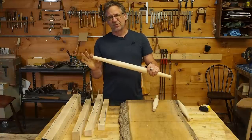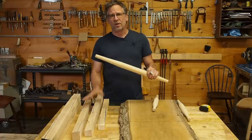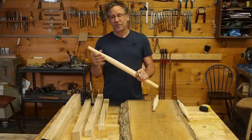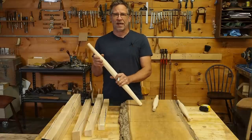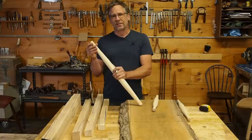We're going to specifically dry the tenons on the legs so that they're super dried. Even with the kiln dried wood, you can still bring it down some in the moisture content, and that way when you assemble it, you will get a differential between the seat and the tenon, and that is going to make it so that you can experience some of that locking we like when the tenon swells back up after drawing the moisture off of that seat.